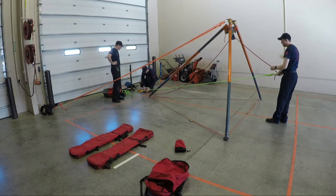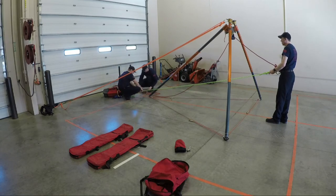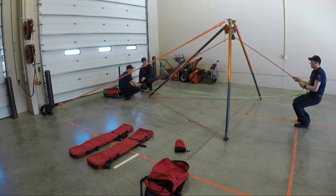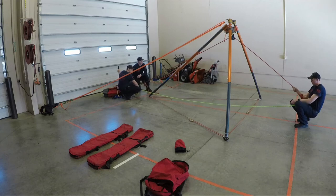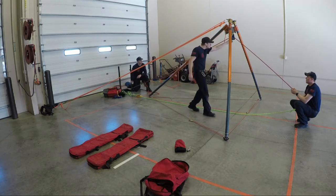So our four key safety factors are met. We have the guy line rule of four covered because we have the two tensioning guys with the three legs of the tripod. We're preventing any slips because of the properly tensioned guy lines. We're preventing any spreads because each leg is hobbled independently. And we also have made sure that the resultant force is properly placed inside the footprint of the Easel-A tripod.